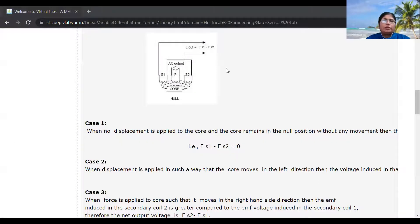This is the schematic of the LVDT. The LVDT consists of a primary winding and two secondary windings. The core is present in between the secondary and primary windings. The EMF generated across the secondary winding S1 is represented by ES1, and the EMF generated across secondary winding S2 is denoted by ES2. The output voltage is equal to the subtraction of ES1 and ES2. When the core is at the null position — that is at the center — the flux linkage with secondary windings S1 and S2 will be equal, so the EMF generated across S1 and S2 will also be equal.